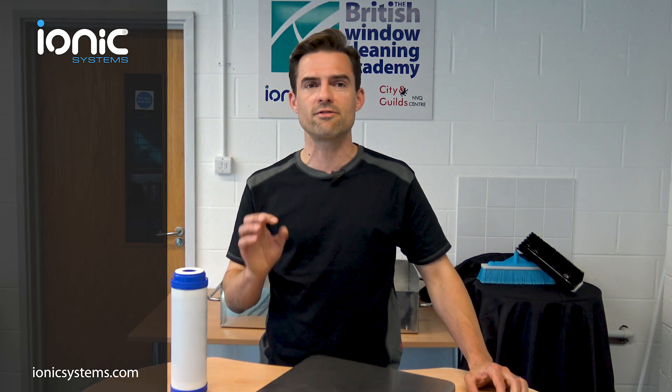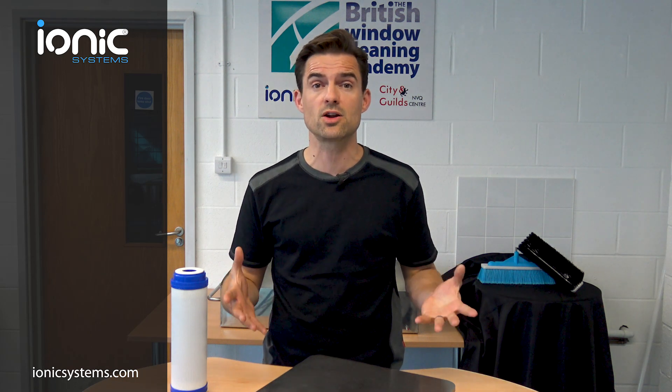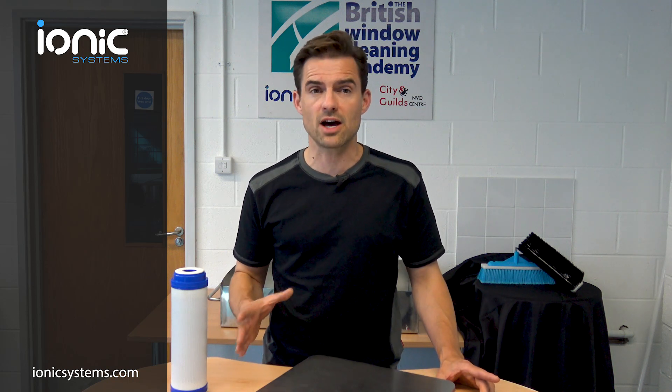This is a carbon filter. Typically they're made in China and contain carbon granules made from coal. Carbon filters are used to remove chlorine from tap water. This is important because chlorine can damage the thin film RO membrane, so that untreated water may pass through, which in turn will increase the burden on the DI filter, leading to more frequent replacement of both the RO membrane and the DI filter media — both of which are expensive.